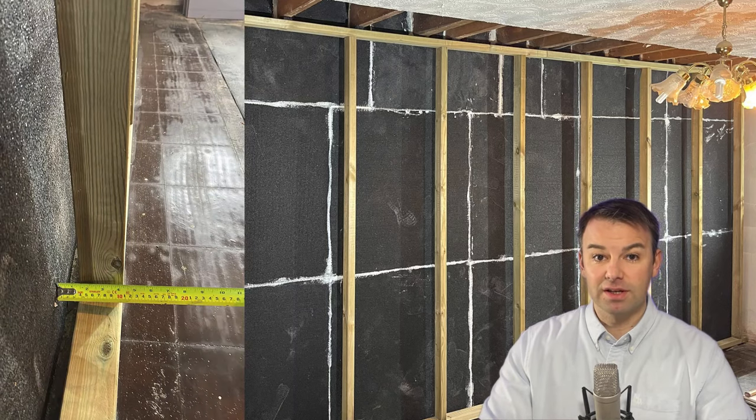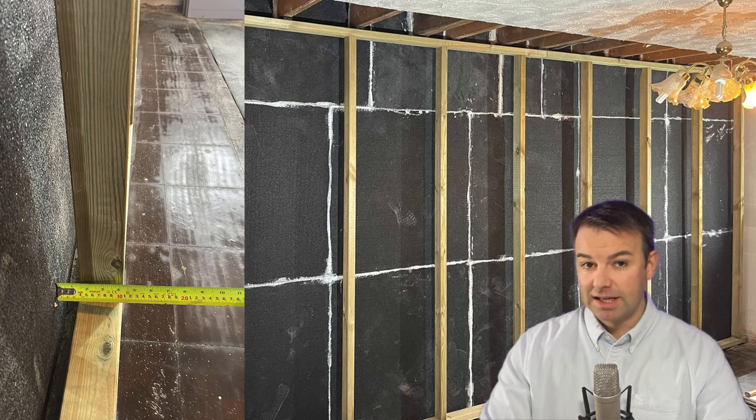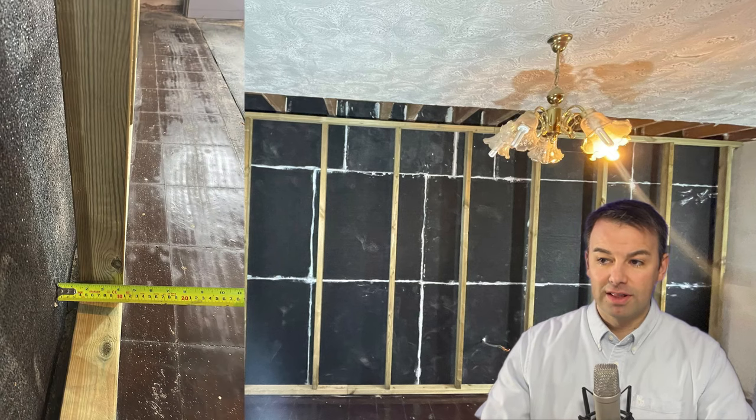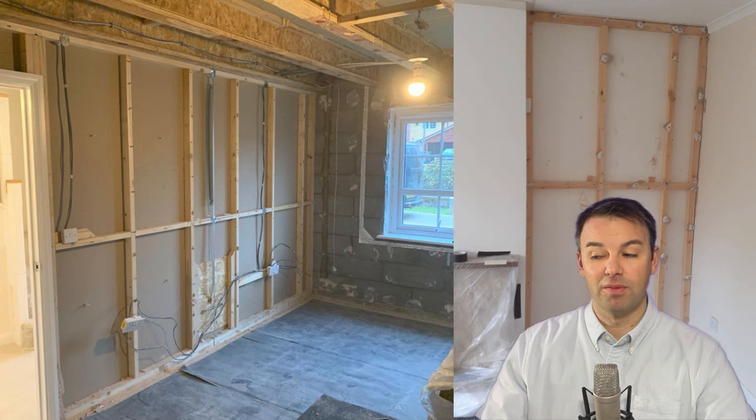This floating frame is without a doubt one of the most important parts of your soundproofing. If you're hearing dogs barking, low frequency bass noise, kids running up and down the stairs, or clonking and clanging — you can see how sound deadening the wall and then creating that isolation with the frame is going to give you a massive reduction in noise compared to a traditional stud frame where you've connected the top plate to the ceiling joists, the bottom plate to the floor, and the upright studs to the flanking walls — effectively injecting the noise into the frame.